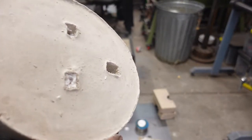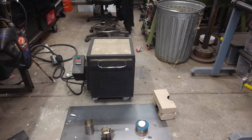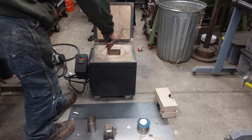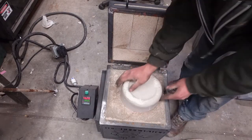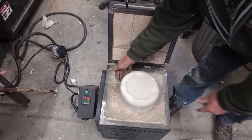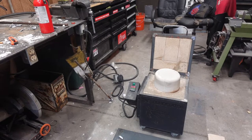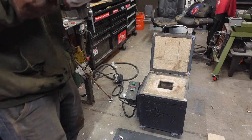So, I got our plaster mold. What I'm going to do for the burnout is just stick this over top of the foundry and let it sit for hours. Hopefully that will burn all the PLA out — or it will explode. This is going to be our catch basin for the melted PLA. We put it on, being careful to make sure those spouts are over the top. Ideally we don't want any of the inside of the foundry poking out. So we can leave that for hours. I've run off to work and come back — my girlfriend kept an eye on it, don't worry. This thing has been running for a good five hours.